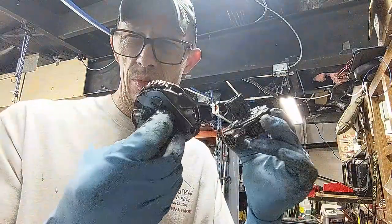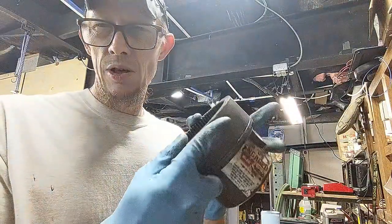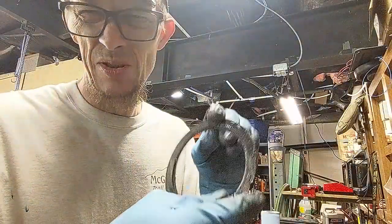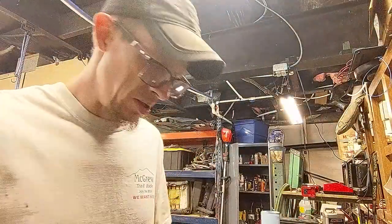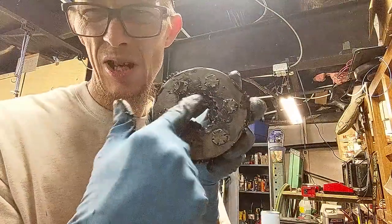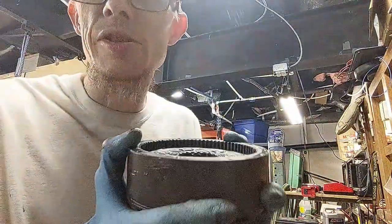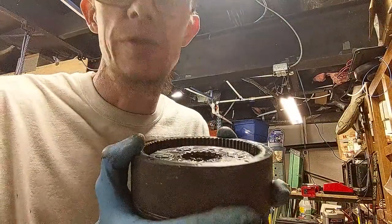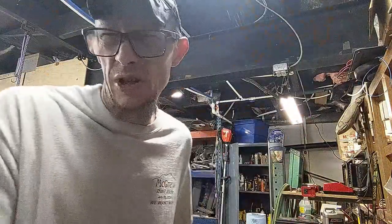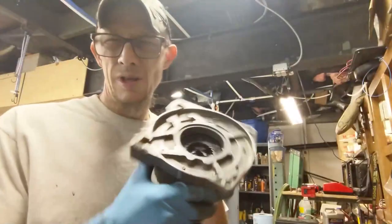Now that the two planetaries are lubed up, we can just drop them down in the hole - run the smaller one down in there first. Now both the planetaries are in, you can go ahead and add this last gear set. Then the thrust washer comes in - this has got a little notch. You want this notch facing the large planetary gear. It's all lubed up. This is the gear side where it runs the drum, so this will go out or up when you're assembling here. When this is all assembled you can see that planetary sat down and it looks like it's a pretty solid three-eighths of an inch reveal. Now we can go ahead and assemble the cases together - remember these are keyed. This one's getting clocked a little bit. Case is all bolted down.